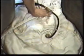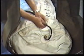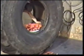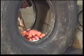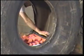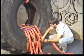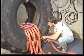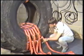Pull up the inside flat airbag to protrude above the bead by approximately 100 to 150 millimeters and switch off the air supply, leaving the cylinder bag slightly inflated. Check that the air and electrical cables are in such positions that they are not trapped and will not obstruct the harness. The harness is then assembled and the strap tightened. Care should be taken not to over-tighten the straps.